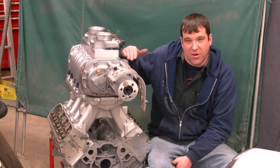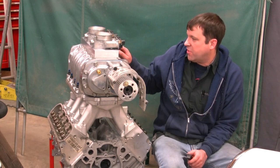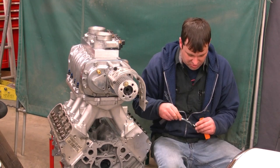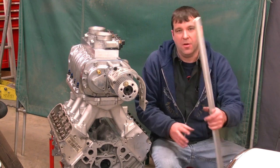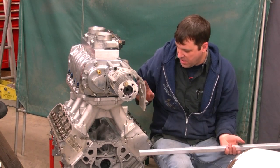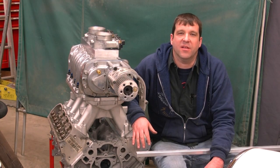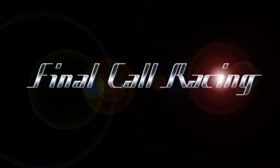The thing keeps growing a little bit every time I put a part on it, but it should be done growing now other than when I put it over the top of the throttle bodies. Next week I'm hoping to get the injectors put in the top. I bought a special drill bit made just for drilling out injector holes — it has all the steps built in so I don't need multiple drill bits. It was very expensive, so hopefully it won't be the only time I use it. I also bought some raw fuel rail, dash 6 this time, to get holes drilled in it and get the injectors ran up there. I'll run the factory Holley setup down below, and I'll have an idler pulley to tension the belt for the blower. Thanks for watching and please like and subscribe.